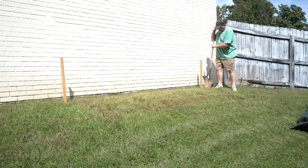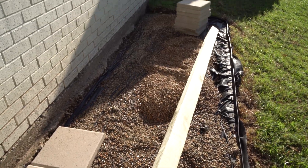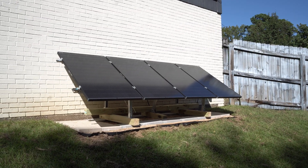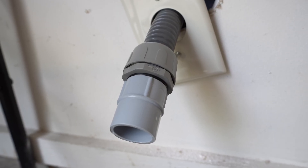I can always drag my solar sled out in the driveway, but I want to mount these so they're out all day. My backyard faces south. This section of wall gets sun starting about 9am and that lasts till about 4pm when the sun shades over the yard, with more direct sun in the middle of the day. My basic plan is to remove the grass in the area, secure the solar mount to wood pieces that are in turn secured to the ground. I decided not to drive wooden posts into the ground in hopes that metal will last longer. Those anchors aren't here yet, so I'm going to install them when they are. In the meantime, I'm going to get power into the garage and into the Mega One using this small piece of conduit to go through the wall. I also need to earth or ground the mount — there's some debate about the necessity of this, but it could help direct a lightning strike away from my system.